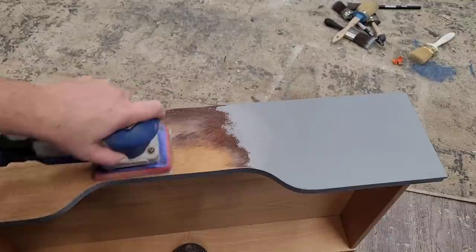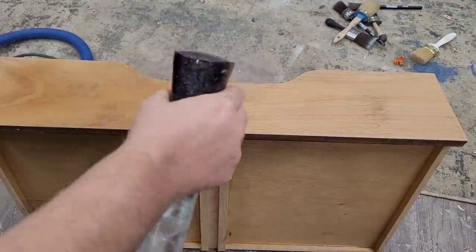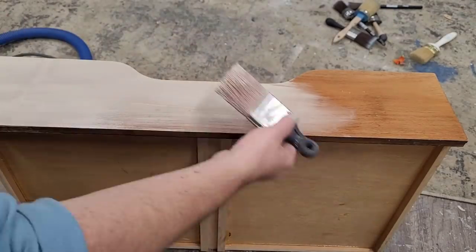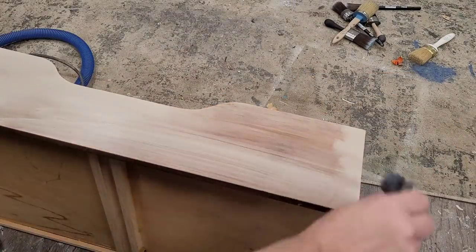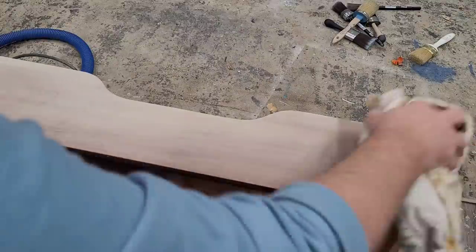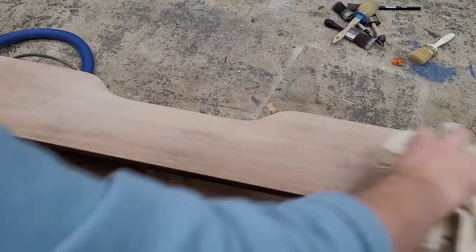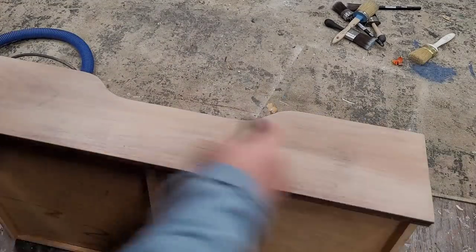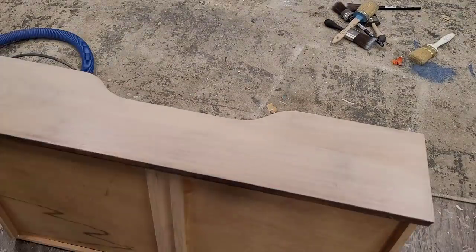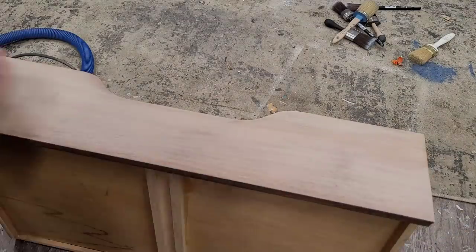I want to give these a bleached wood look, but I don't want to use a wood bleach because this is a really thin veneer — the wood bleach requires a lot of moisture and can cause bubbling in thin veneers. So I'm going to give this a painted finish to simulate the look of bleached wood. Using Rethink Junk paint in a color called Oyster — a nice light creamy white — I applied a thin watered-down coat to the front of my drawer, then wiped it back with a rag using long even linear strokes in the direction of the wood grain. I ended up doing two coats for a really saturated bleach look.